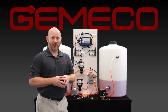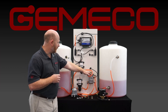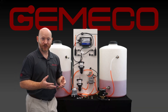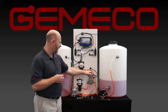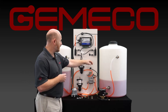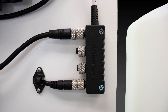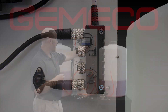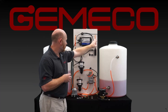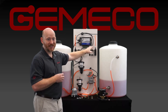One of the common questions we have about our fuel meter is how do you get the connection — how do you get the data from the fuel meter to the vessel's NMEA 2000 network — and it's actually very straightforward. With the fuel meter, it comes equipped with a factory six meter cable, and that six meter cable terminates in a DeviceNet connector, which in this case is connecting to an ActiSense SBN-1.